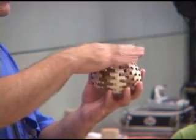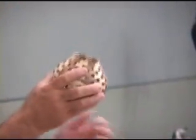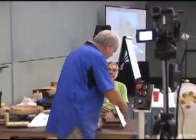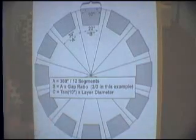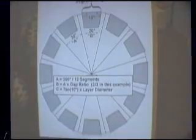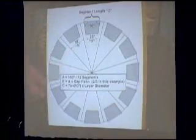The top of it is a regular solid segmented ring. You can use just a solid piece of wood for the top, but from a design point I think it looks better to have a glued-up ring in the top. I have a drawing. If you divide 12 into 360 degrees, you get 30 degrees, so each one of these segmented areas takes up 30 degrees.